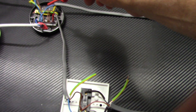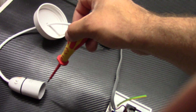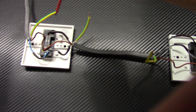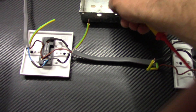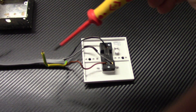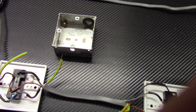Remember, when you connect to the ceiling rose, there is no neutral in the switches. The neutral is only at the neutral terminal in the ceiling rose and also in the light fitting. Here it is just live and switch live. All the earthing wires you connect to the back box. In this switch you connect two earthing wires to one back box terminal, and in this switch you have just one earthing wire, so you connect that to the terminal as well.